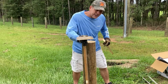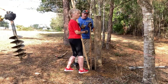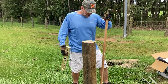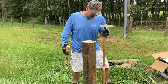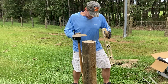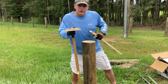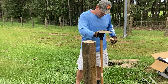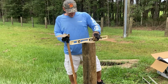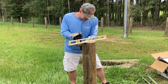I'm just packing it real tight, getting that clay down on the bottom and going around it with a hoe — it's pointed a little from use and it's light. I've got a wooden packing stick but I forgot to bring it. Packing it tight at the bottom is the most important thing for any kind of post — fence post or mailbox post — because that's what keeps it from wiggling up top. I got it perfectly level; I cut that with a chainsaw without a square and I'm impressed it came out so square.